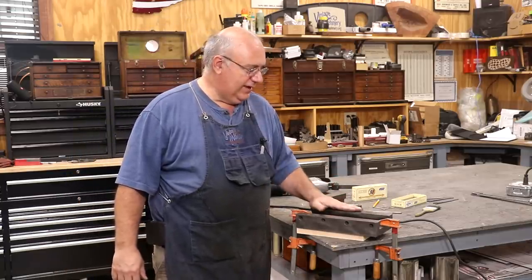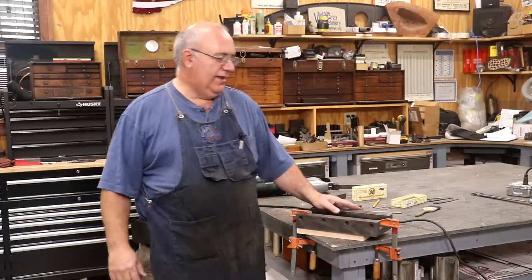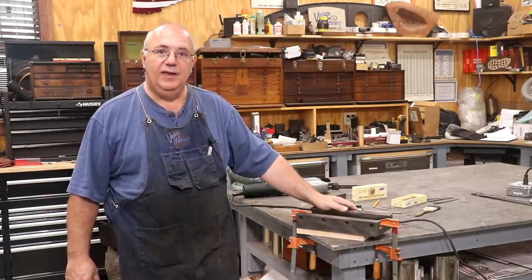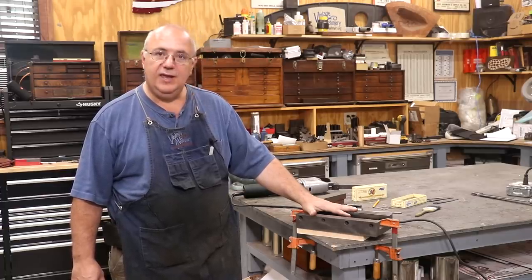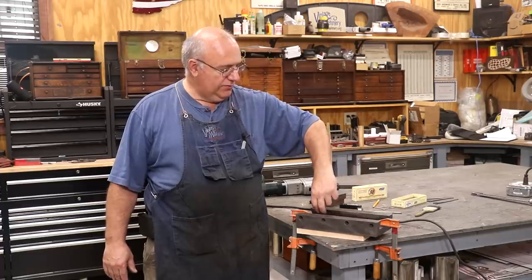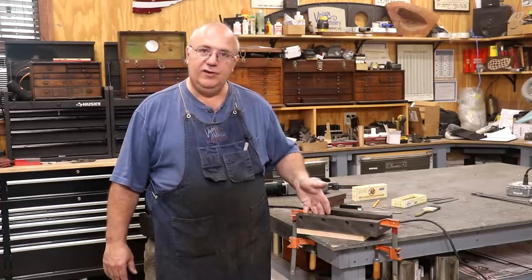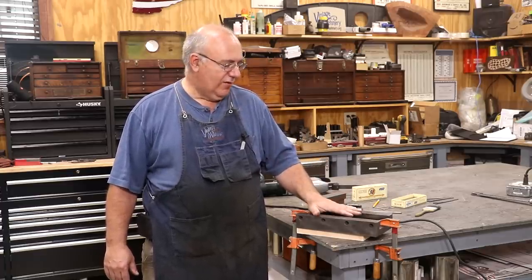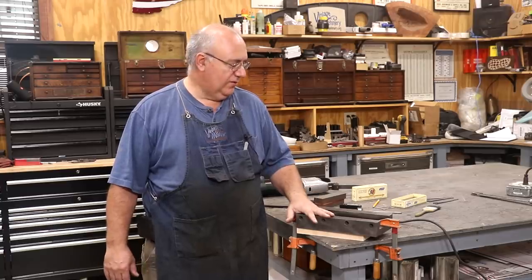Today what we're going to be doing is working on the cross slide that is on the clapper box — I call it a cross slide, it moves the cutter up and down. It's basically like a cross slide on a lathe with dovetailed ways, and we need to get this thing scraped in and ready to use. I have got the top part over here on my bench and we're going to start scraping it in, starting by scraping the bottom end flat on the surface plate, then scraping one of the inside dovetails. The other side has a gib, so we'll scrape the gib — and we actually have to make a new gib. Then we'll use this as our master to scrape the mating part.